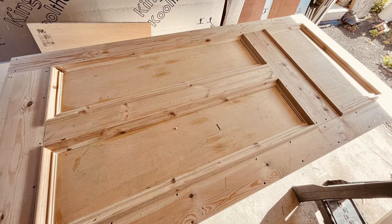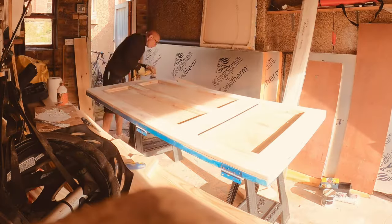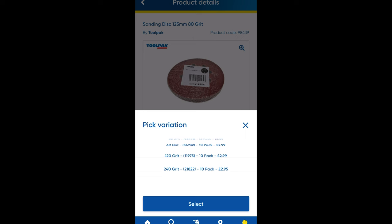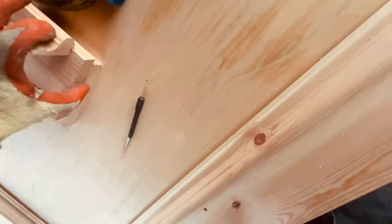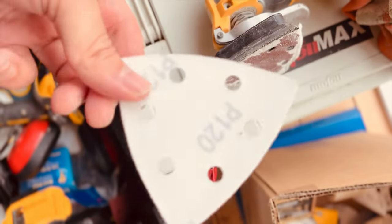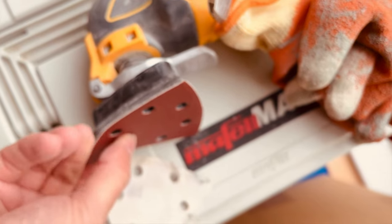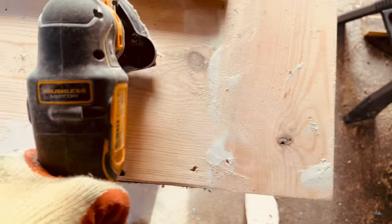For preparing my timber door once it's laid flat on my sawhorses, I'll sand off any existing paint and fill any gaps then sand off again. For a brand new door I'll use 80 grit sandpaper to start, followed by 120 grit. This simple sander works great and costs very little, but I've also got recessed panels and mitered section moulding — the triangular sanding attachment with a multi-tool is perfect for getting into those corners. I cannot recommend a multi-tool enough. Get the surfaces smooth, go over with a fine dry brush to ensure there's no dust and we are ready to go.